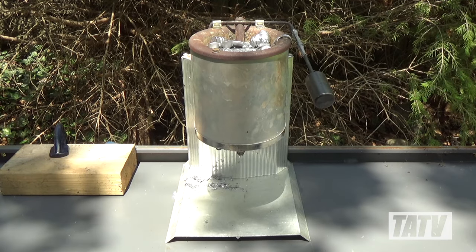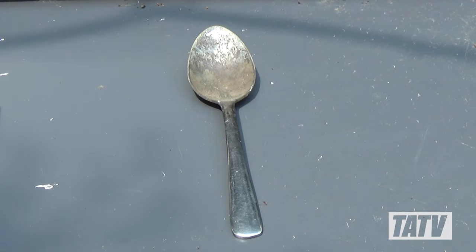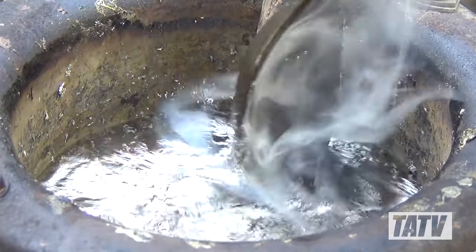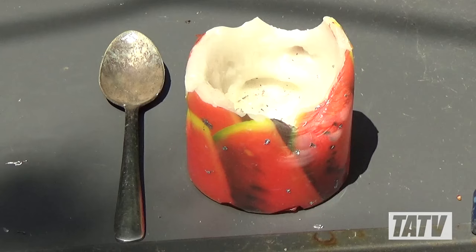You'll also want to have one or more molds ready to go. We've also got a stainless steel spoon — nothing fancy, just an ordinary spoon. This is for skimming the dirt and impurities off the top of the lead as it melts, as well as stirring it to keep it properly alloyed when we flux the pot. To go with our spoon, we have some paraffin wax. A cheap dollar store candle works just fine for this.